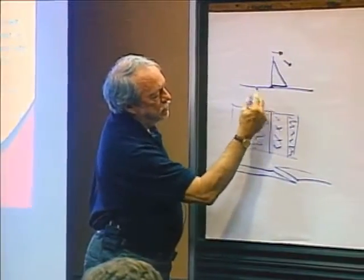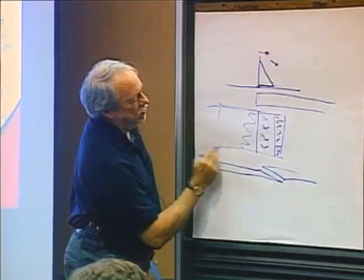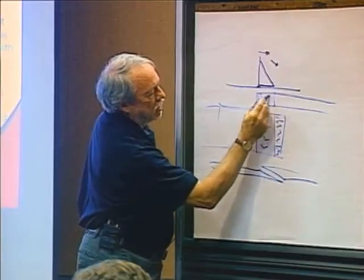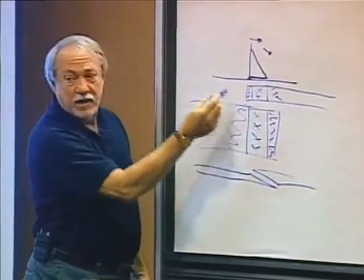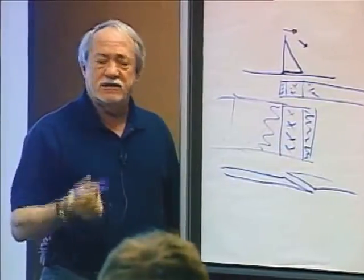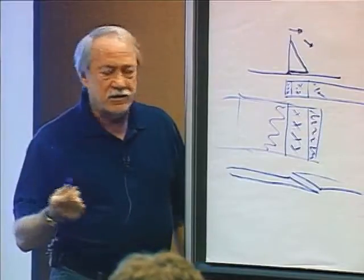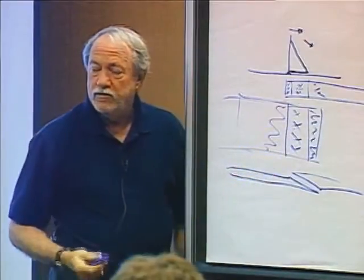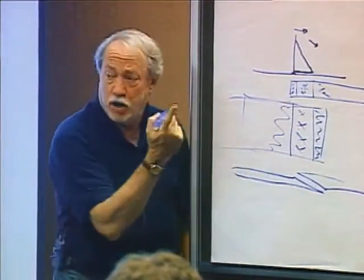In other words, this won't be the right dimension, but this is the other part of the belt. This belt's going this way. This is the other end of the belt, where you have, again, the rubber exposed, you have the nylon exposed, and then you're back to rubber. This nylon and this nylon has to match up because that's where the strength's at, right? So what you do is you use a catalyst. It's not an adhesive, it's not a glue, but with a chemical process, the catalysts melt the nylon to the nylon. So when we do these splices, it's very, very important that you do things like match lines.